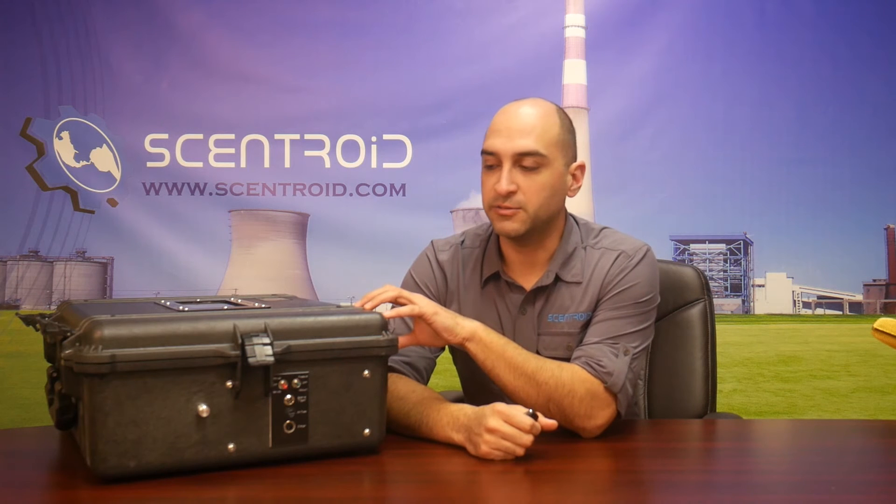Another really interesting feature is that it has an external trigger, so you can connect it to one of the other products like Sentinel, a timer, or some other circuit. For example, you can instruct the Sentinel to turn on the vacuum chamber if H2S levels exceed 40 ppm. You can also put it on a timer so that, let's say from 2 o'clock in the afternoon, it starts for 10 minutes.